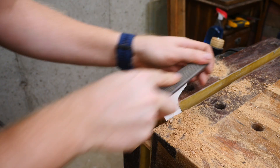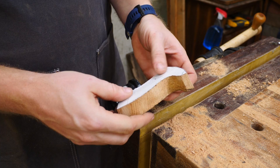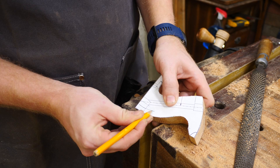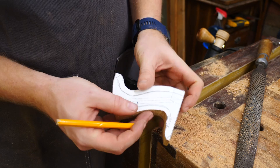Now it is shaped and smoothed out, and I need to go through carving this and actually wrapping it all around to make it feel good in the hand. I'm going to start with a very heavy rasp, take off a lot of material, and keep feeling it — does this feel good, do I need to do some more work here? To get an eyeball on how much I'm taking off around the edge, I'm going to use a pencil and put a mark in a little ways — that's basically what I want to get rid of on most of this.